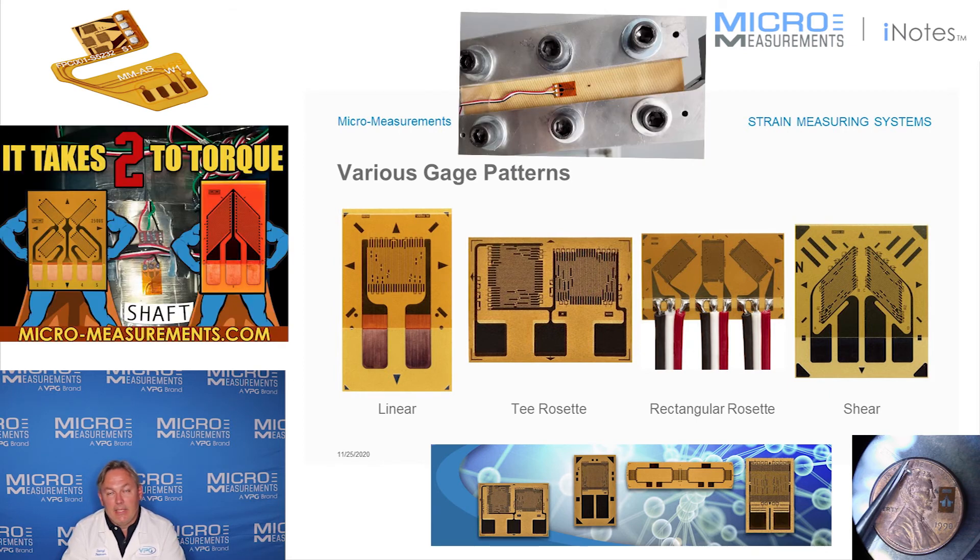The last one is a half bridge shear pattern, very commonly used for two applications. One would be torque on a shaft — for example, a shaft in a paper mill where you're trying to measure how much torque is going through it, and from the torque and speed you can calculate power or horsepower. Often customers will use two of these and wire them together into a full Wheatstone bridge, then calibrate it for torque. This gauge is also commonly used in shear testing and shear modulus testing, where you take a small bow-tie specimen, put it into a fixture with these gauges on it under a pure shear load. The gauge provides feedback for the shear strain measurement, which you can use to establish the shear modulus of that material.